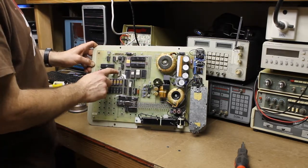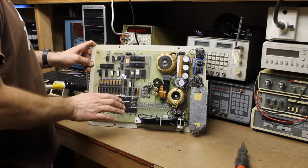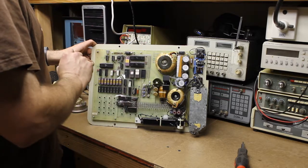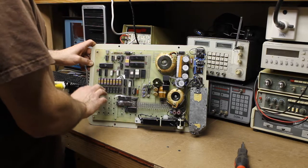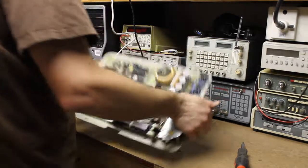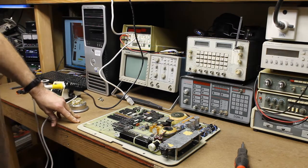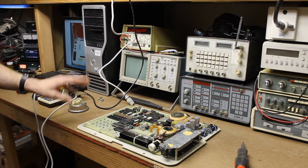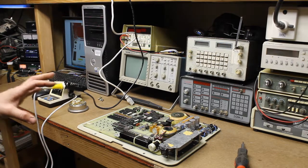You can't see it because it's small, but there's an uninsulated copper bodge wire here. I covered some of this circuitry with Scotch tape just to keep it from making contact, but it's time to go ahead and open it up and figure out what's wrong here. The other issue is that this is from the early 80s and it has plated through holes, which from that time period are notoriously bad about having issues. So we're going to go in and repair that and see if we can get everything going the way it needs to be going. I'm going to go ahead and pause the recording, get things taken apart, and get started on it, and then we'll come back to it.